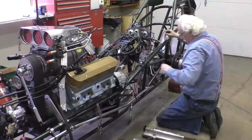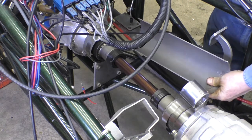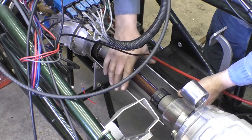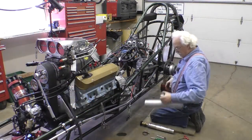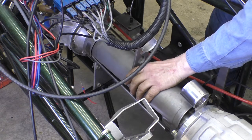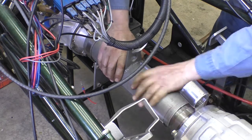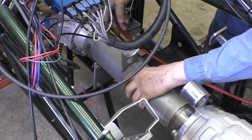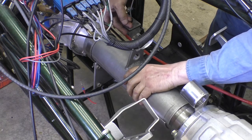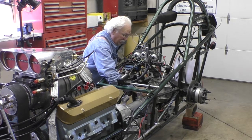We've got the coupler in. Now this next piece is what protects me in case this driveshaft lets go — that goes up there like that, and this piece goes in here like so. Then we slide these even. There's also a sensor down here — a magnet and a pickup that measures driveshaft speed. I've got to make sure that's clear, and it is.